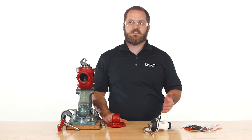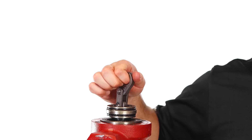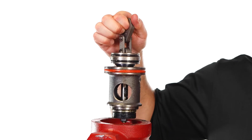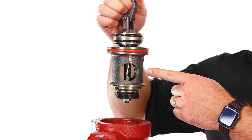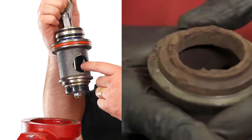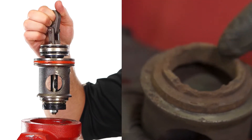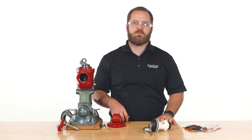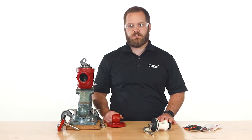However, sometimes during repair you'll find that other internal components are damaged that are not part of the repair kit. If the ratio plug or cage has excessive corrosion or erosion, or if the stem is bent or the stem nut has pitting, they'd all need to be replaced, resulting in more time and installations needed. Mostly, you simply find you just need a quicker method to getting back to production.